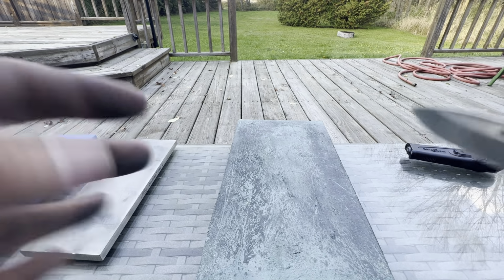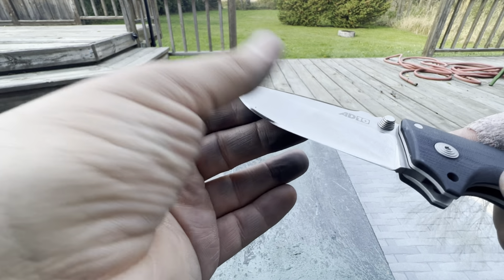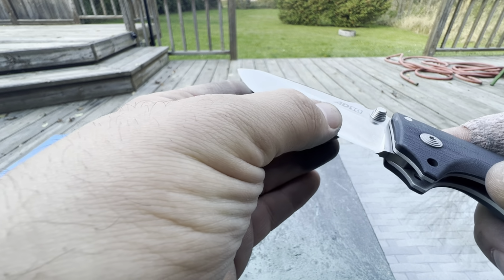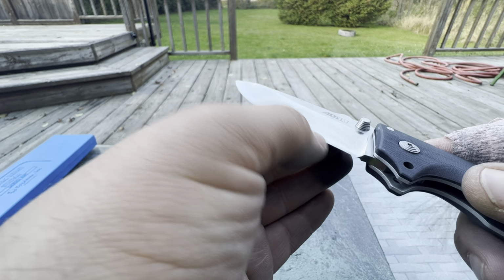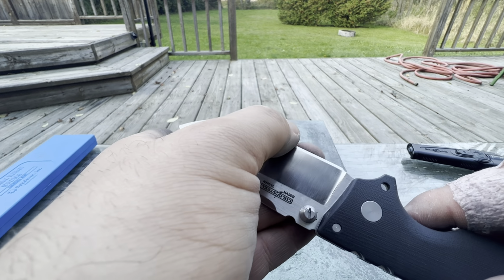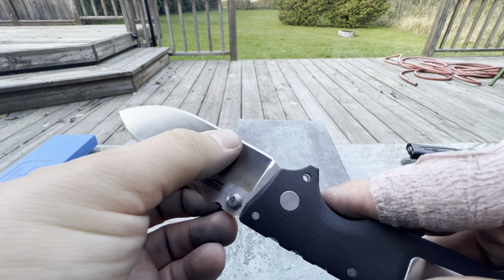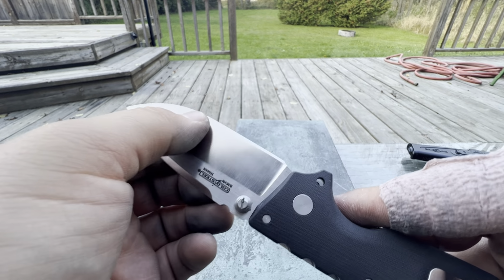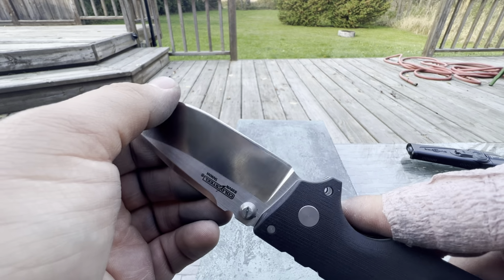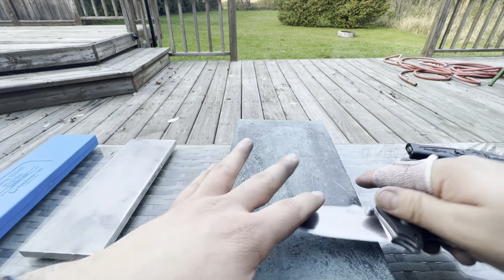Very good. So, at this point, I actually feel if there's any side that doesn't feel rounded, if there's any real harsh catching, nothing major there. I feel like maybe there I feel it catching on my fingerprints. Like barely. Maybe right there. A lot more there than anywhere else. So I'm going to keep wanting to strop this side.